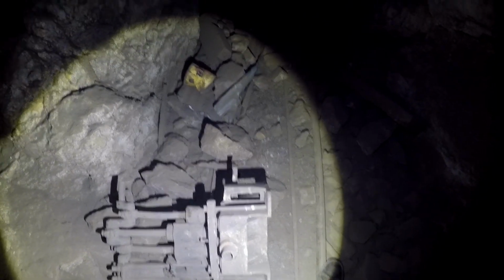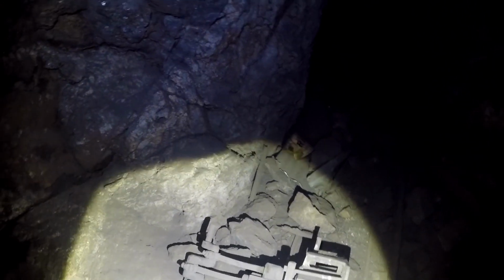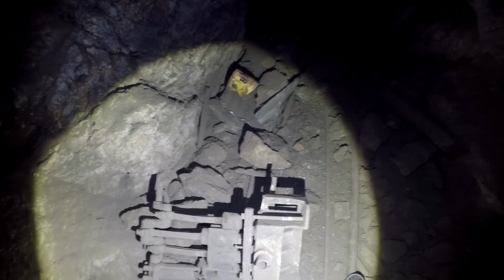So that's why for things like skyscrapers and other large, tall structures where you have to get water up high, the pumps are at the bottom and they force it up. So you're pushing it into the pipe and it's got nowhere else to go but up. But if you try and pull from the top, like sucking, there's a maximum height. I can't remember the theoretical limit. It's not much. It's like 30, 40 feet. And then you pull an absolute vacuum and it just doesn't move.